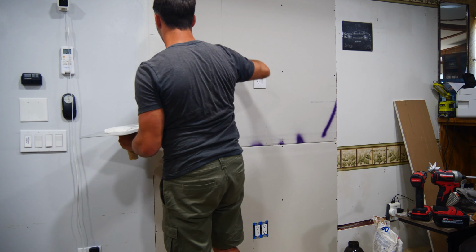And now it's time for a speed round for painting. I'm using Glidden's Diamond Paint in Elemental Gray for my walls. It's a wonderful single coat paint that dries quickly and leaves a wonderful finish. It doesn't splatter everywhere when rolled at a somewhat quick pace, and it's a combination paint and primer, so it can go directly over bare drywall.